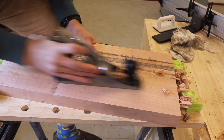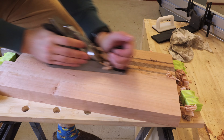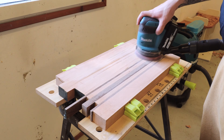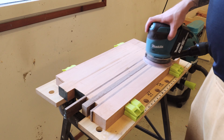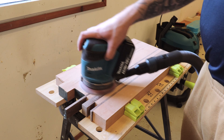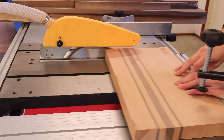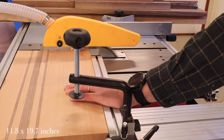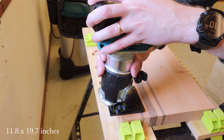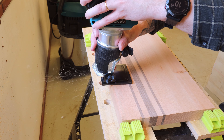So it was a matter of planing it by hand, but gladly there wasn't too much planing to be done. After I had planed the board to be mostly even, I gave it a rough sanding to even out any remaining bits. Once the first round of sanding was done, it was just a matter of cutting the board to its final dimensions — around 30 by 50 centimeters. I also got a palm router for myself and used it to round over the edges of the board.